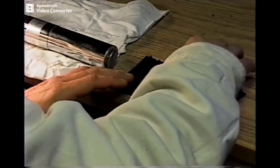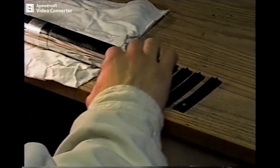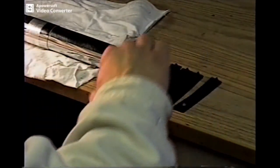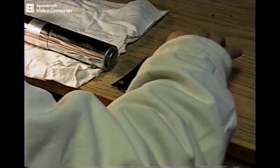You're going to want to let your alcohol dry because we're going to rub down the saber with alcohol before we apply these grips. You're definitely going to want to let the alcohol dry before you apply the grips, otherwise the grips will not stick and you'll mess up the other side of the double-sided sticky tape and have to take the old tape off and reapply it — it's a real pain, because once this rubber sticks to that tape, it sticks.